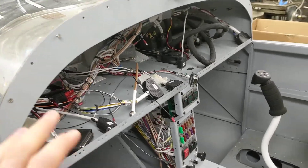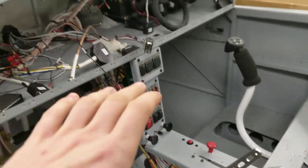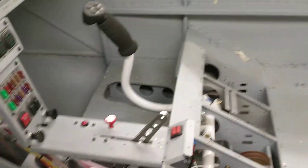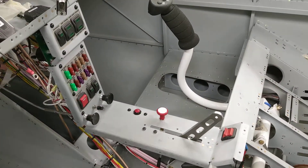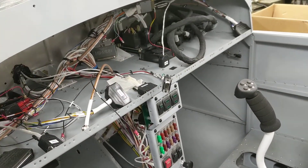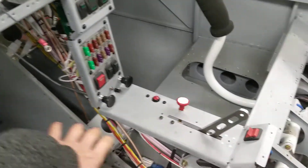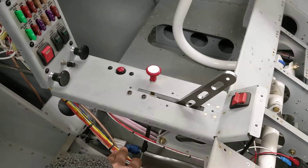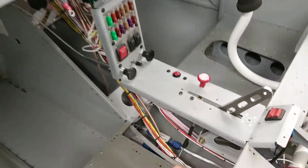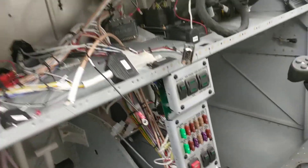Once all of that is done, the plan is to power everything up. We've bled the brakes — the brakes are all good, they're all working fine. The plan is to power up so we can test the fuel pump and confirm there are no leaks in the fuel system itself. All the pumps are now on there. It'd be good to have the control systems read the fuel pressure and so on. It's nice, just before we close all these panels out fully and start tying all this wiring down, to test the fuel system and confirm everything works as it should and that we don't have any leaks in any of these fittings down here or any of the fittings that run up through to the front of the plane.